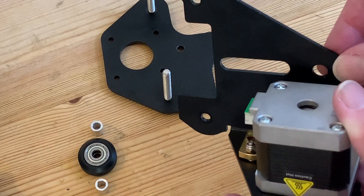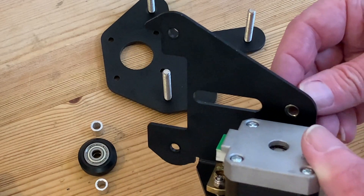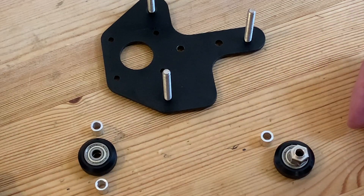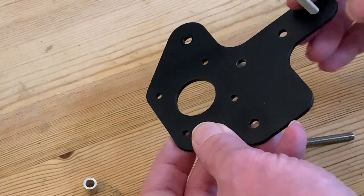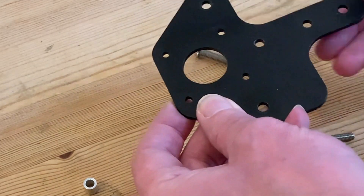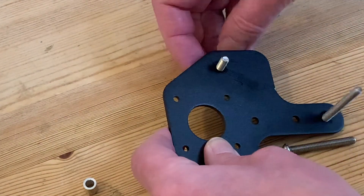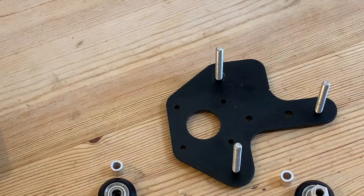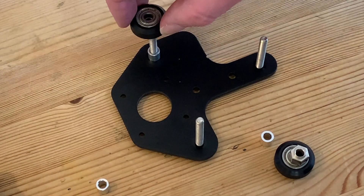Taking a quick look at the back plate, we can see how that adjustment collar works — with a slightly larger hole and an eccentric cam which moves the axle bolt from one side to the other. We just need to make sure we get that in the right place when we put it back together, which we can start doing now. This is the plate that caused all the problems by being pre-assembled in the factory upside down, and all we've got to do is flip it over. Then we can start reassembling, pushing the bolts through from the other side and stacking the spacers and wheels on top in the exact reverse of taking them off.